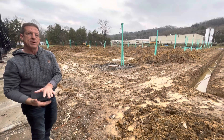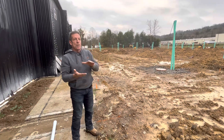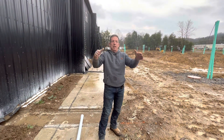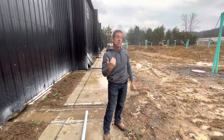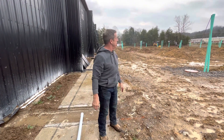Then we put a fabric down, load gravel on it, and compact it so the gravel in the yard are all the same height — you don't have a pile of gravel here and a low spot there. Everything looks beautiful, uniform, and nice. Believe it or not, we're doing awesome. I know it looks terrible out here, but it's got to look bad before it can look good.